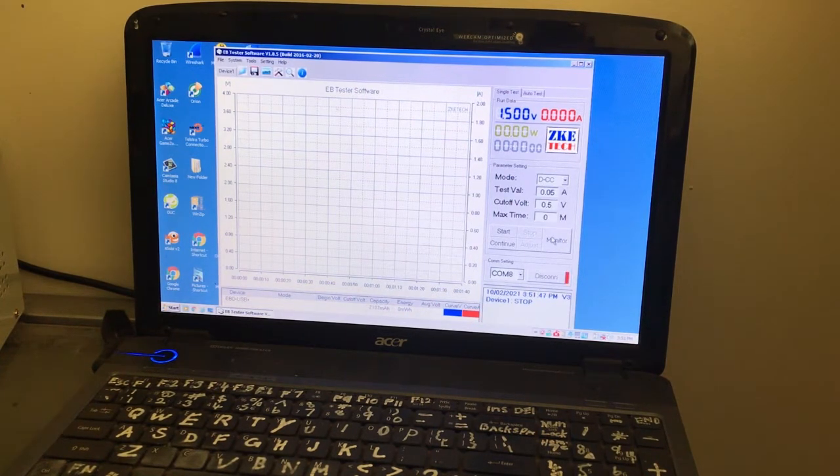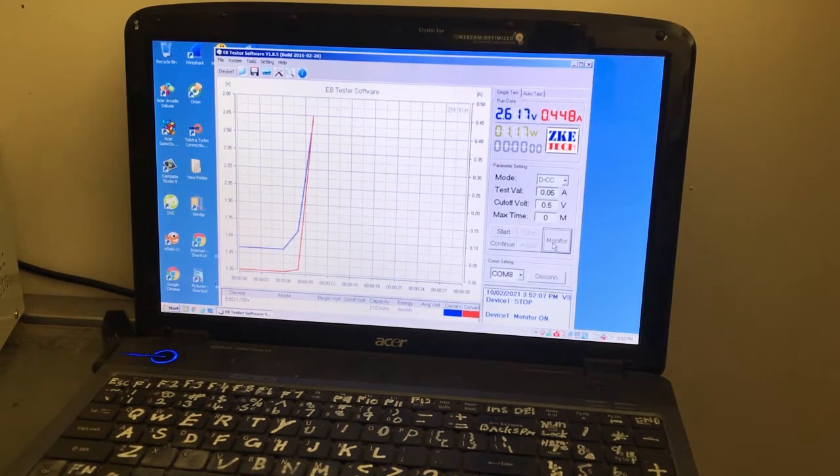So I'll set up for a charge at 2.4 volts. Okay, connecting the charger now. It'll take a while for the binder to soak in as well. So I'll give it about an hour, 2 hours, just for the first charge, and then tomorrow, when I get more time, I'll charge it more. So the electrolyte's gone black already.